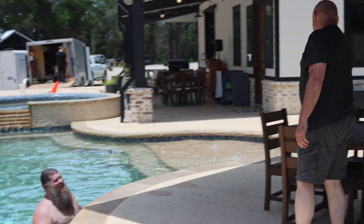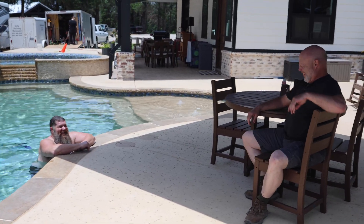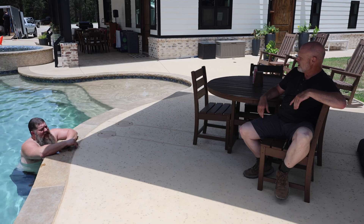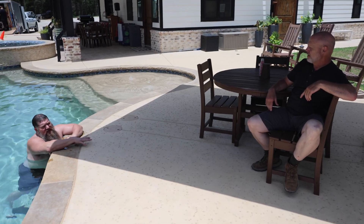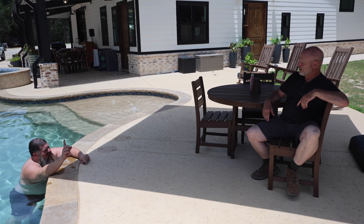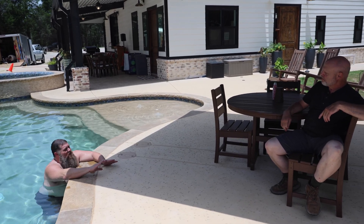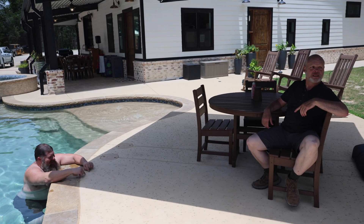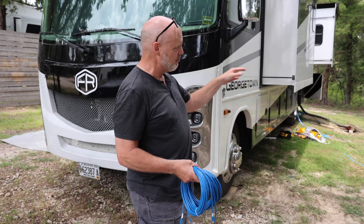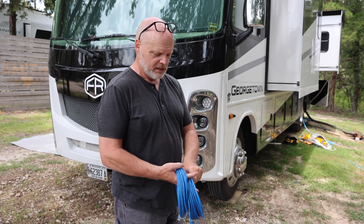I think it's close to lunchtime. It's hard watching y'all do all this stuff. So the boards are in, mounted. Both inverters are in and on the mount but not secured yet. Next is, if that's all secure, we're going to turn our attention back to the battery piece. Once we drop the batteries, we can go ahead and leave them in there because you're going to measure between the batteries and the disconnects having the link system up top. The great thing on these batteries — they already have the disconnects so we don't have to wire that in.